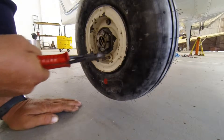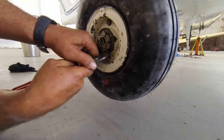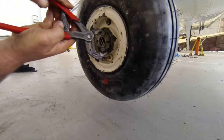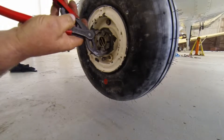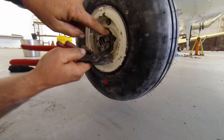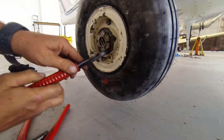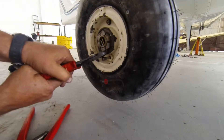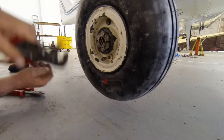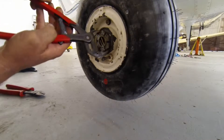Cut that one because you don't want the leg too long. You just bend that leg back that way and get it out of the way so you don't cut yourself. You've got to have both legs bent to lock it properly. You don't want to bend it back into that shim behind you. Make sure you've trimmed off enough so that the leg is not going to make an impingement on that. Yeah - that's clear.